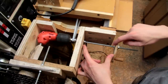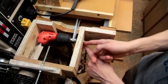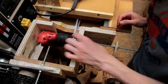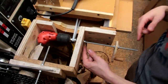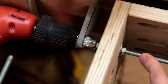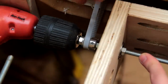The shaft which the handle attaches to is just a simple threaded rod, and that is mounted to two little roller blade bearings which I've attached in the plywood. There's one bearing on each side of the plywood and I just drilled a little recess to house each of those bearings. The shaft attaches to this little 16 tooth timing pulley which runs the timing belt I've got running along here.